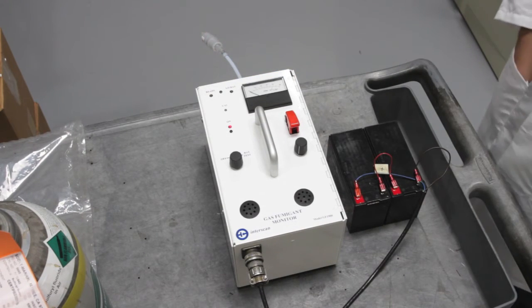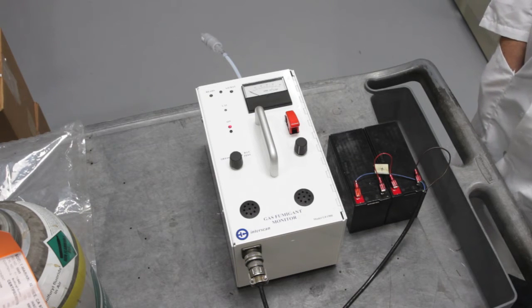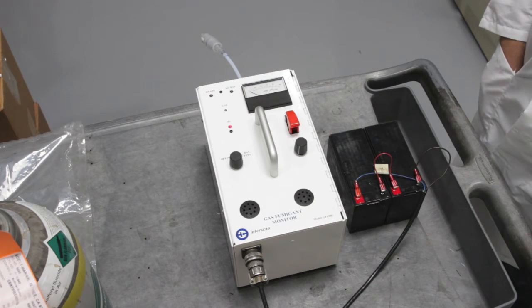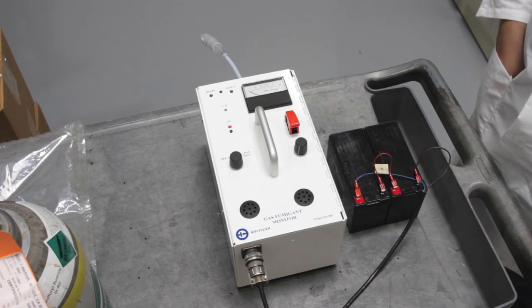Continued drifting after the ready light comes on will create an erroneous zeroing of the analyzer. Additional runtime may be required if this condition continues. Remember, a true zero cannot be achieved. You may only perform clearance or calibration once the monitor is stable.